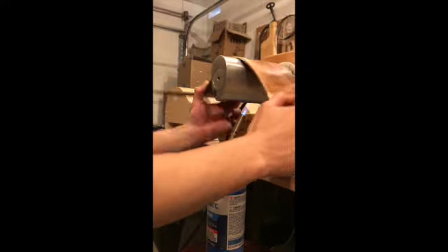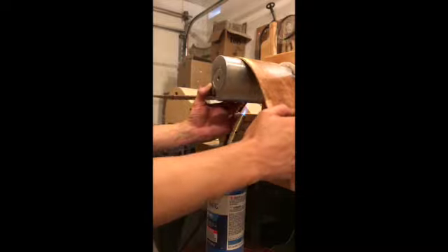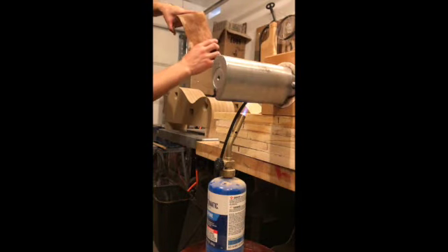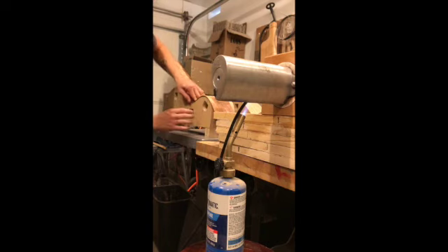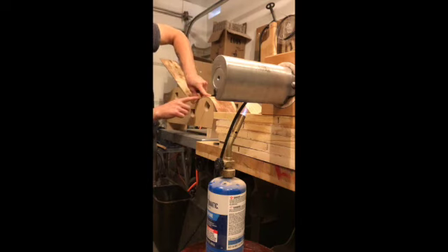There's always going to be a kink or something to be worked out later — that's the way guitar making goes. Whether you bend over a blanket, a form, or a mold, there's always going to be an area that doesn't bend perfectly. You can force it into the mold and build that tension in, or you can go ahead and correct it while it's happening. I choose to correct it while it's happening. My side is bent really nicely to this shape, and I've made a tick mark where I want to continue the bend.